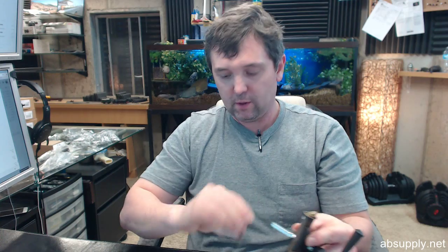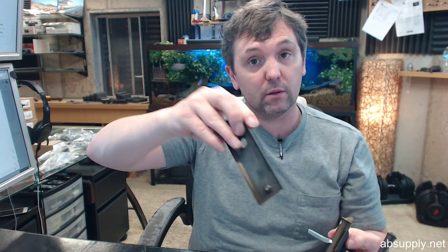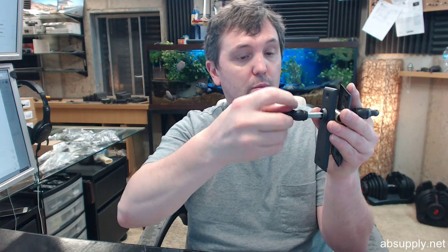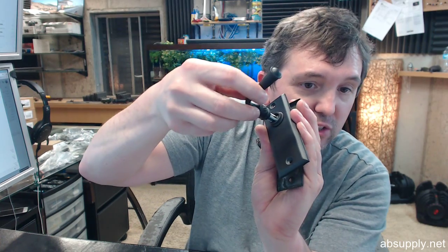So once you have the spindle coming through, you'll bring your exterior escutcheon, or the opposite side, bring that through there. Okay? And you're going to, like I just did, rotate that, thread it onto the threaded spindle. Be careful, don't cross-thread it. Turn that till it gets to where it has to be. Tighten up that set screw down in the base. That's here. And you're in good shape.